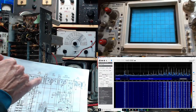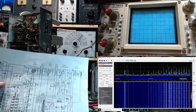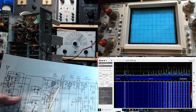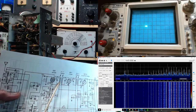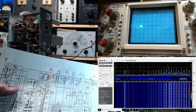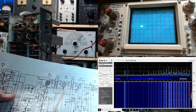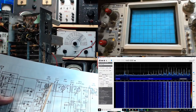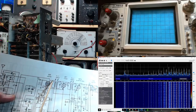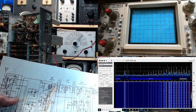So a bit of a mystery here — it really looks like from this point you can monitor what's coming out. And of course you can't, that just can't be the case. My own personal theory is when this resonant tank circuit here is not resonant, if you apply a frequency other than the resonant frequency, it just falls through and eventually works its way somehow to ground. It just gets eaten away. But when this is resonant, it produces a very high impedance at the resonant frequency, which is 460 because I tuned it that way.